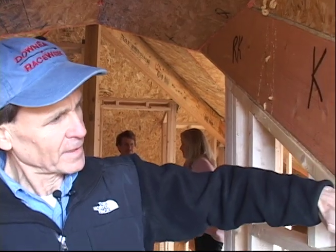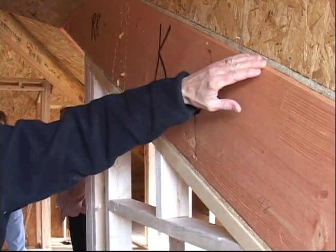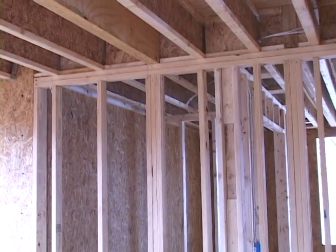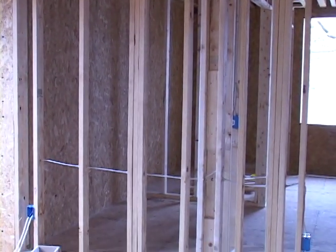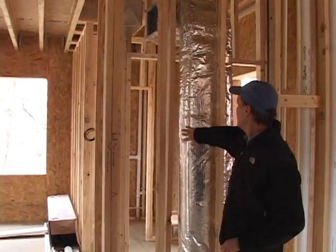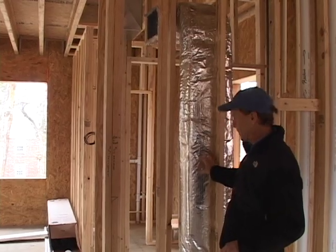This is the thickness of the panel at the roof. The air moves into the house through the living spaces and is exhausted through the bathrooms and kitchen. The hype about Passive Houses is they don't need a furnace — and they don't. That's the main duct that carries all the air from the mini split system. They do need to keep fresh air moving through the house constantly.